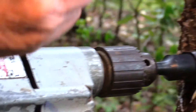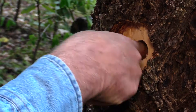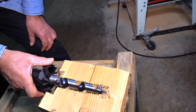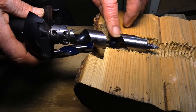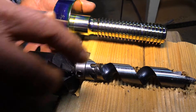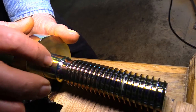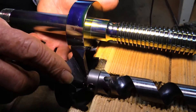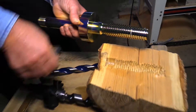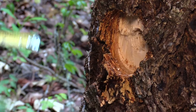I can tell we're at least into our minimum depth because of the color of the chips. The bit is an inch and an eighth and you can see the lip in there. It's really important that you line up all your bits — the three-stage bit lines everything up: it does the one-inch part for the inside diameter of the thread, then the inch and three-sixteenths for the middle section, then the three-inch counterbore — so everything bears at the same time, bearing here, here, here, and here.